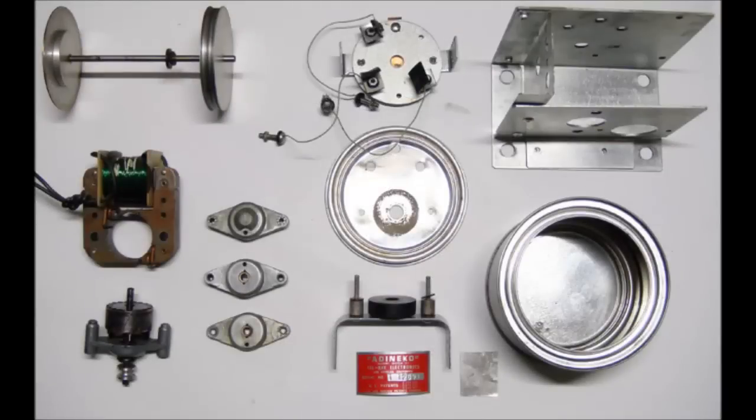This is a picture of the same Tel-Ray oil can that we saw in the earlier picture, but now it's all taken apart. If you look in the upper left, that is actually the disc. That is the backside of the disc, where the front side is what is actually recorded on. In the top center are the three wipers that, instead of being the sort of round things like in the patent drawings, are actually flat, wide wipers. And those are static. They do not move. And you can see the disc is mounted on a pulley that is spun. So you have that disc spinning around, rubbing against those wipers. There's also an electric motor to turn them, and the can to hold the oil.